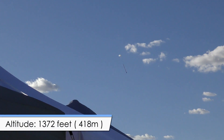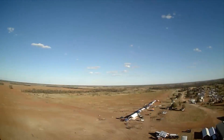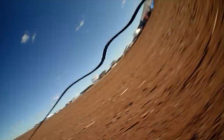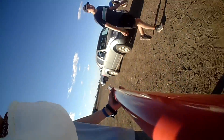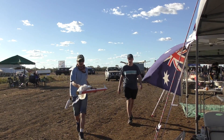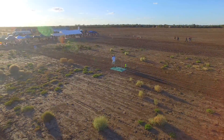It is bent — it might have bent under acceleration too. The onboard altimeter gave us a maximum altitude of 1372 feet, which was a little lower than the predictions for this pressure. This was mostly due to weather cocking because there was a really strong wind blowing at the time. The parachute deployed as expected and brought the rocket down for a safe landing. We decided not to fly it again as the rocket also had a slight bend in it and we weren't sure how bad it might get at the high pressures.